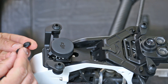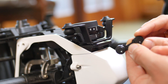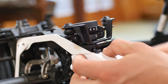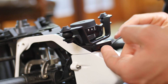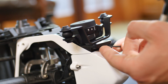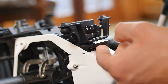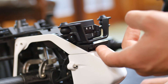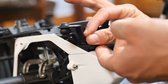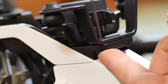When you're putting this base plate in to screw the screws into, these screw holes go towards the front. You're going to put it in like that with the round circles there, and they go under here. It helps if you have an Allen wrench — you need one to screw this in because the screws are in fact Allen key screws. This should fit somewhat like that into the hole there. Then you take one of your screws and screw it in with the Allen wrench. I'm not going to tighten one side without getting the other one in first. And there we have it.